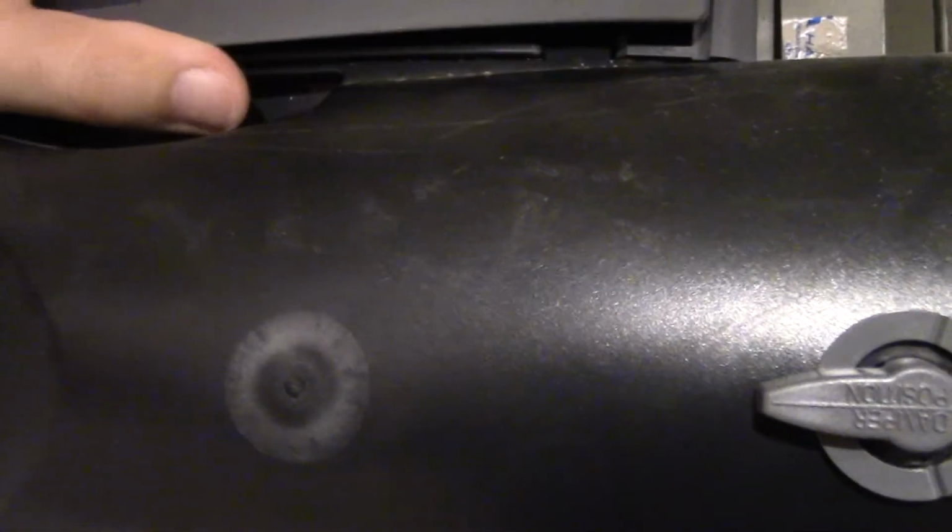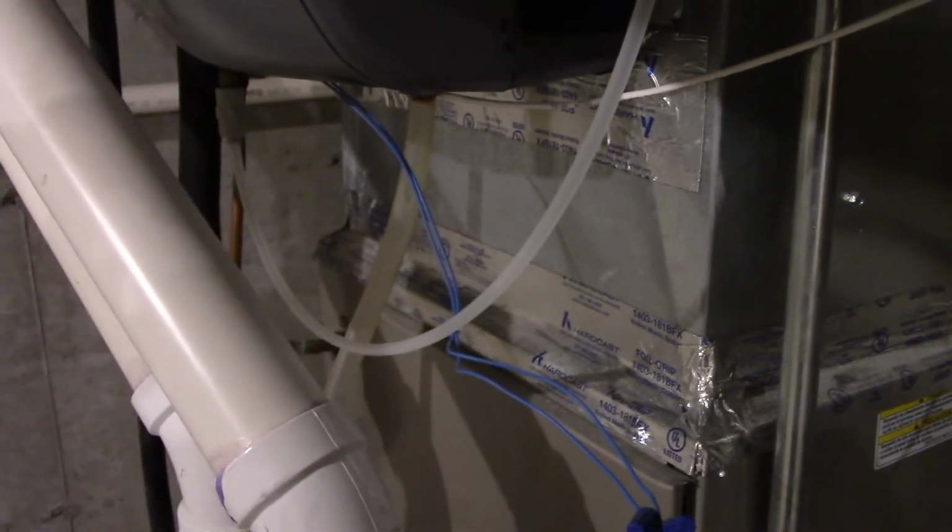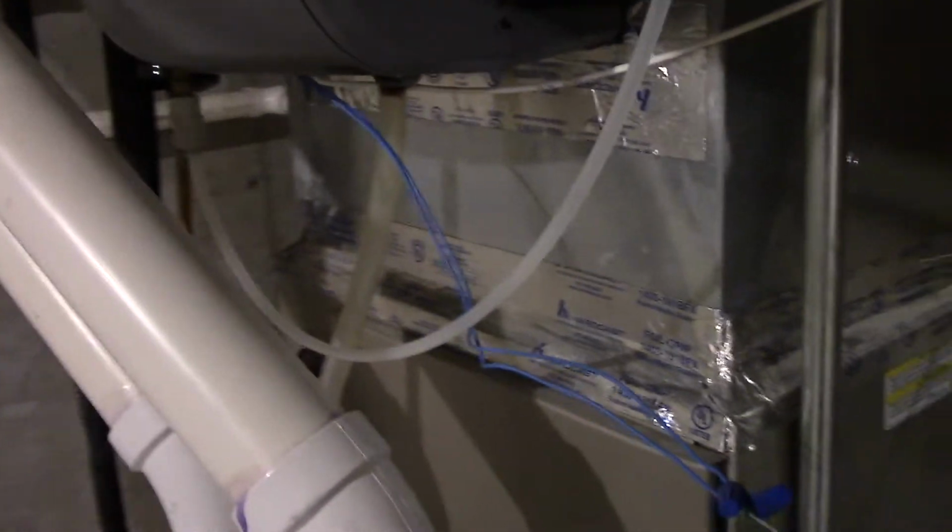So it goes through this pad, and then through the return duct, and then back up again, and that's how it humidifies the first floor, should it need it. That's definitely pretty cool. Let's put this back on. See if I can get it right the first time. Yeah, see, it's a little touchy like that. There we go. All back in place. And we'll put this back to 35, and maybe you'll see it shake this time. It didn't really do that time, but whatever, you get the idea. You just heard the click, the water stopped flowing, and now it's set back to 35.